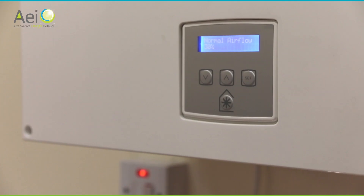The units come with internal humidity sensors. These sensors will detect when you're cooking, washing, showering, or even mopping the floors, and will automatically boost the fans. The fans' objective is to get humidity levels back to a normal level — around 50 to 60%, which is a healthy range. Houses with poor ventilation can see humidity levels of 80 to even 90% in some rooms, leading to mould on walls, damp, and mould spores in the air.